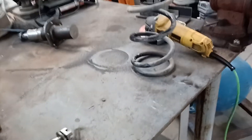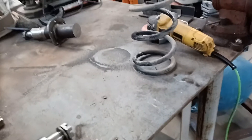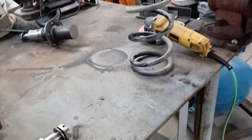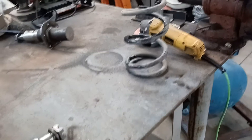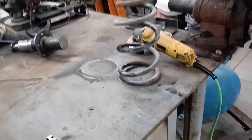I'm going to use a 2-inch ball for normal towing, but I'm also going to be able to use a pintle hook, and the pintle hook has better pivot and better articulation. We don't get too wild with where we go, but we do go through some washes sometimes, so I want to be sure that it's going to pivot just fine through that.